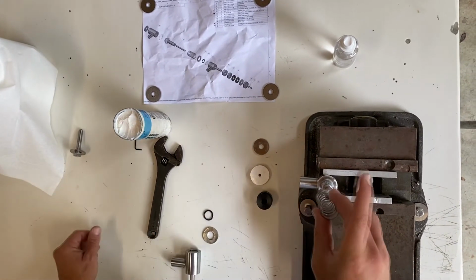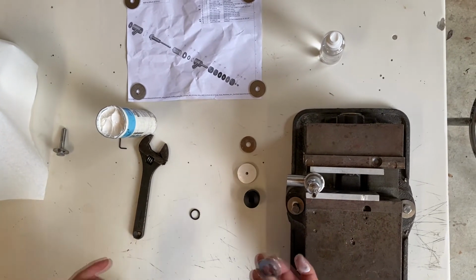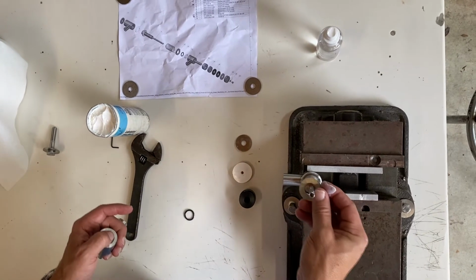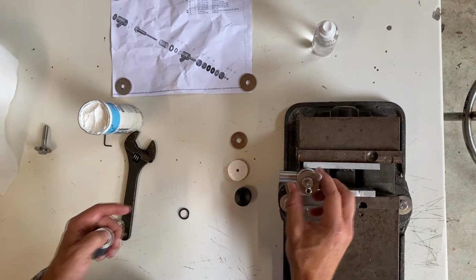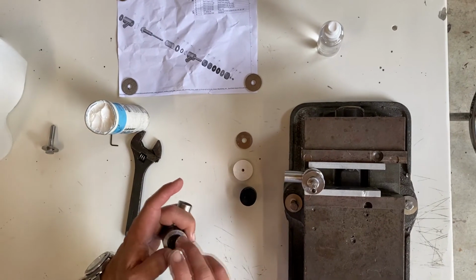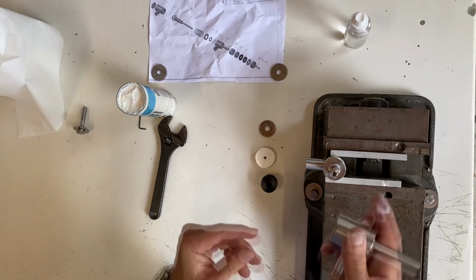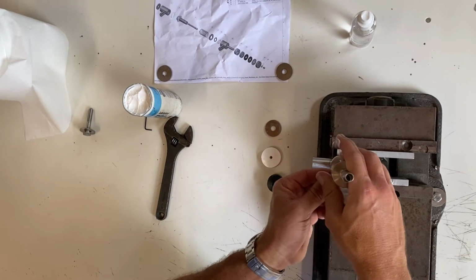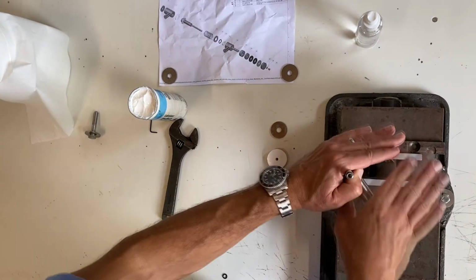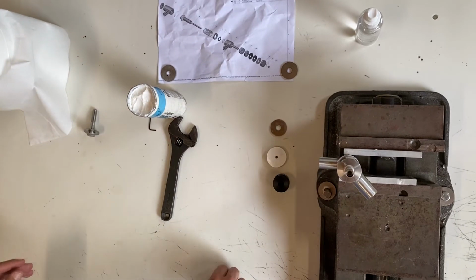You put the spring, then you put this washer, which prevents the o-ring from popping up when you do this. And then you put the o-ring here. The o-ring material, if we don't get specified otherwise, we put Buna. Or you can put Buna, Viton, EPDM. There's a million materials available depending on your application. This would slide freely right now.